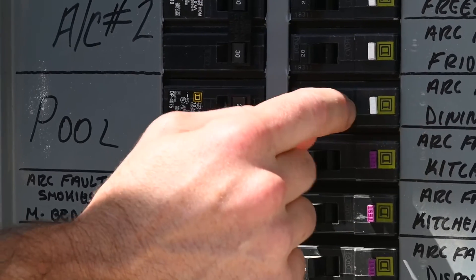Next, let's talk about your electrical items. You want to check for any exposed wiring. If you can get up into your attic crawl space and look around with a flashlight, I recommend doing that, just making sure all electrical connections are still connected. You're also going to want to check all your GFCIs — there are little buttons on your GFCI outlets and you want to trip those annually to make sure they're still functioning. Then take a trip to your electrical panel and trip all your circuit breakers and turn them back on to make sure they're working properly.